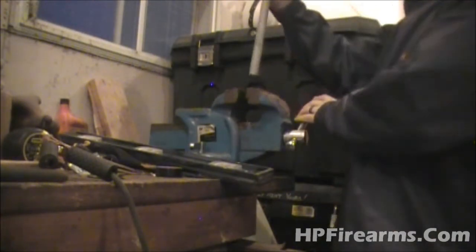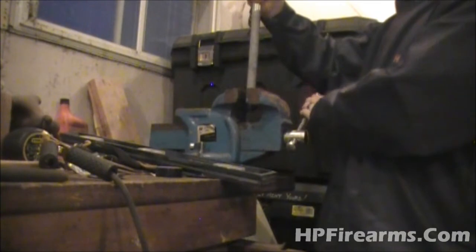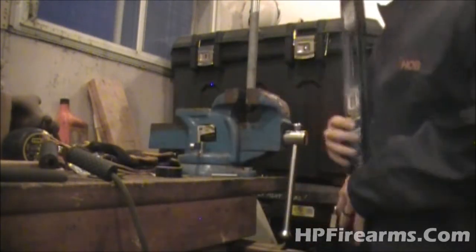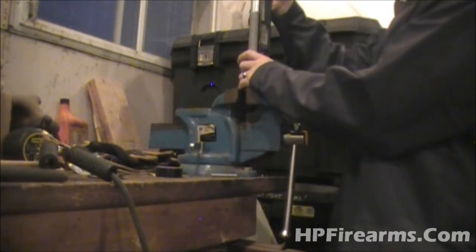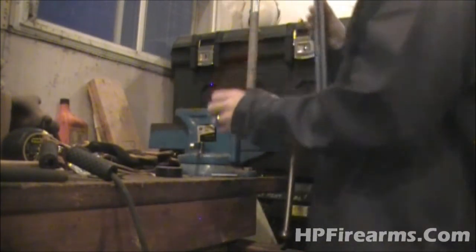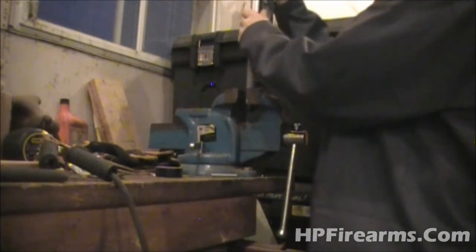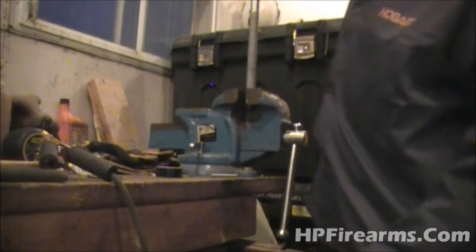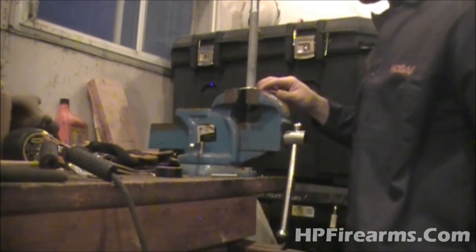The first thing I want to do is go ahead and chuck it up in a vise. I'm going to start with the two-inch mark first and tighten it down right on the two-inch mark. You don't want to tighten it down too much or you'll bend your pipe — just enough that it will hold it steady. Then take a level and put it up against it and make sure we're perfectly plumb up and down, and check it the other way too. Then we're going to take one of our washers and slide it right down over the top and let it set centered on the top of our vise, and that's going to give us a good stable platform to start welding from.